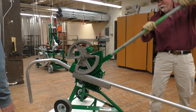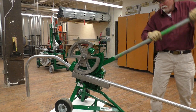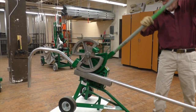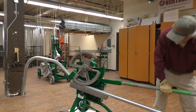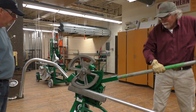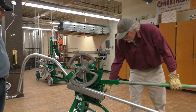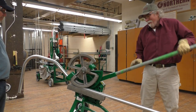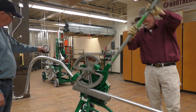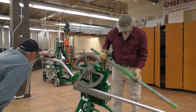We need to make sure the bender handle is in the bend position. We remember we bent it 11 clicks — we had 10 and then added one for springback — so we'll bend it 11 clicks so it goes parallel. Counting: four, six, eight, ten, and then one extra. We'll put this in unload mode and bring it back up — nice bright click to unload. It's in that position. Take the bender handle out so no one gets hit in the head.